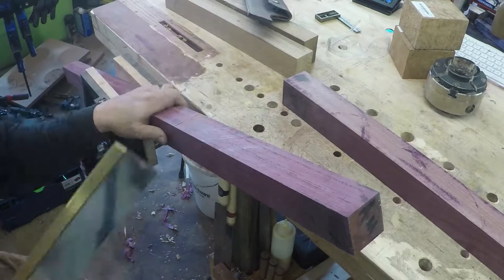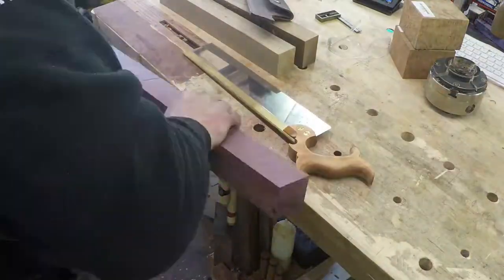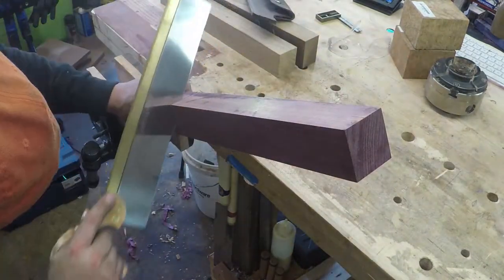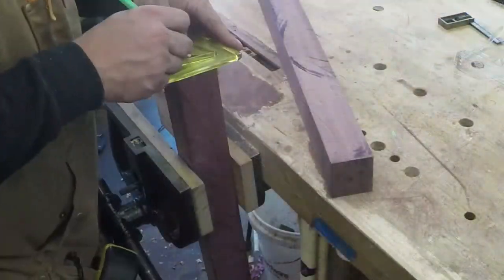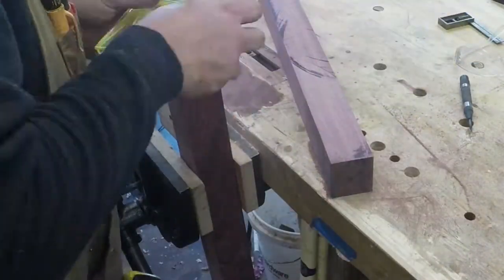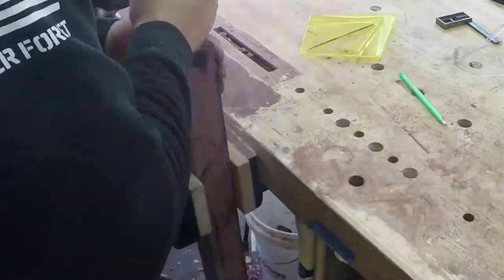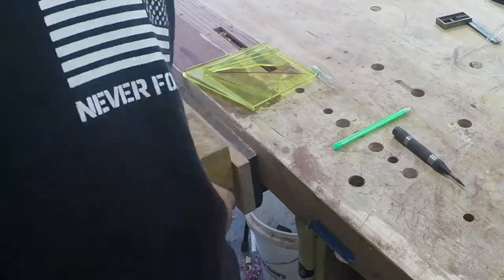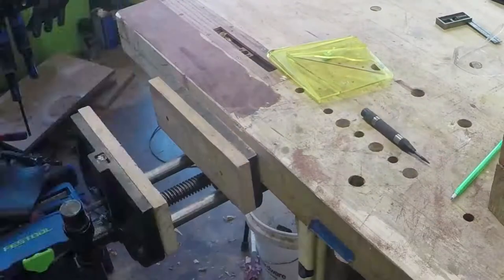They're about 26 inches long, so I cut them about 28 inches, and I went ahead and cut them by hand because I put my chops up. I cut them about 2½ by 2½ to give myself some room. Here I'm just squaring them off and cutting them with my carcass saw. Here's a little tool that I find very handy to find centers — about a $7 tool, and it's really helpful. So I squared up everything before I even get started, and then I put a little punch to mark the center for me, and it's a lot easier to put on the lathe.